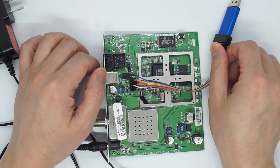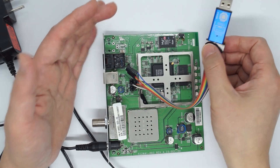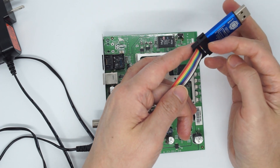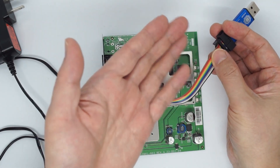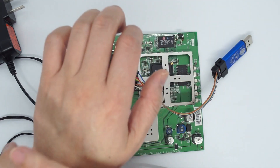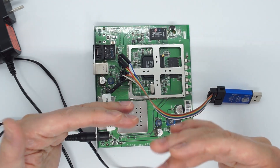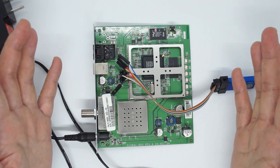I hope this video explains how to make the connection as well as the safety. You do not want to get the U-Link NT and immediately burn it. Each pin is connected to the CPU, which has certain limitations — you cannot inject 12 volts into a pin; it will kill it. In the old days, people used an anti-static mat and even grounded themselves. For an average user, if you follow some basic rules it's safe. Otherwise, you can kill the modem or the link without even seeing any fire — it's just gone.